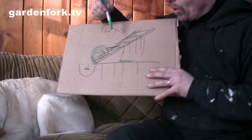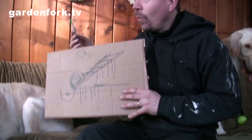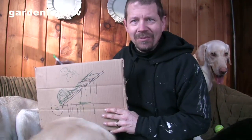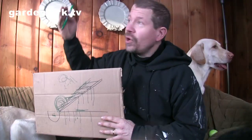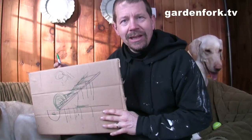Like we showed you. So it can travel. If you see water coming out from between the clapboard on your house, which we just saw out there, or if it's water or icicles coming out of the soffit vents, which we saw out there, that's all a red flag that you have an ice dam. So the water goes into your house, and the water can appear in all sorts of weird places, like it showed up in our kitchen, which is just very odd. On the second floor there's no water, but on the first floor ceiling there was water. It may mean you have a burst pipe, but it also might mean that you have an ice dam.